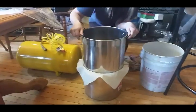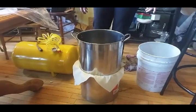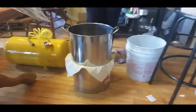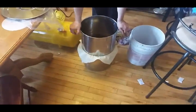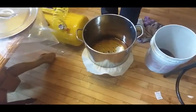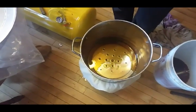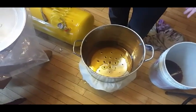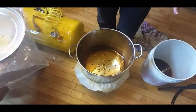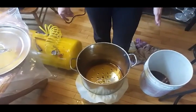And now you want your pots with nothing in there so that one just fits inside of the other, but it's actually a little sloppy. That way when you put this felt in, it makes a nice seal around there. That's one of the reasons that you wet it. Oh, I'm sorry, in this top pot, I forgot, I put a series of holes in with a regular sheet metal type of drill, a step drill bit. Real simple. Stuff you get at Harbor Freight, Lowe's, any of those places.